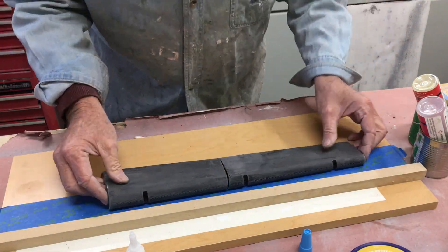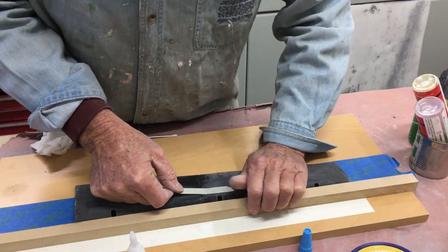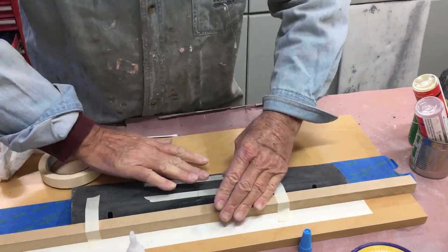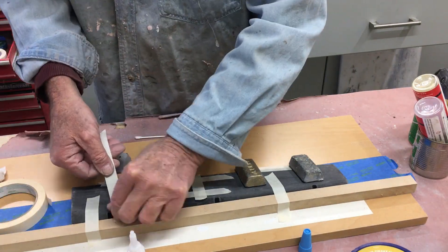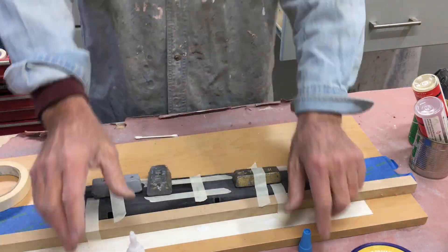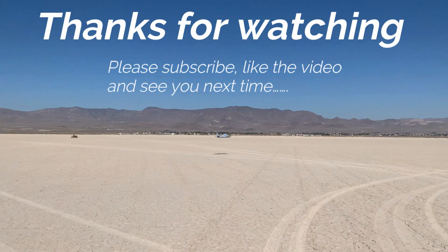I'm using the jig to align the leading edge of the control surfaces. Both the aileron and flaps are in two halves but are pinned together, and in this case I'm using epoxy for these. The next video will cover squaring up the root to make sure it's nice and flat, setting the dihedral, checking all the reference points around the plane such as where I'll be drilling for hinges later. These will be set into the mold so I don't have to keep measuring all the time — lots of good tips on how to set these plugs up ready for the molds.